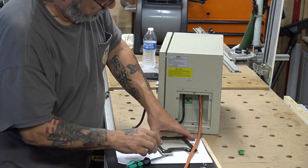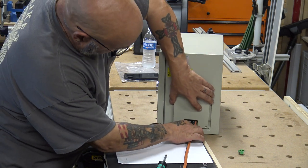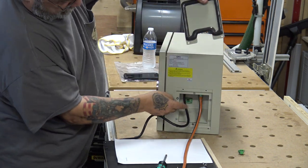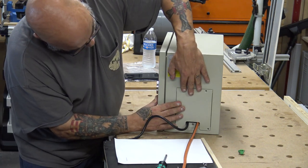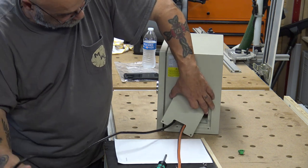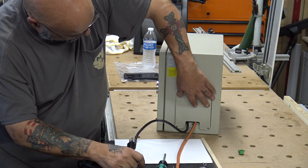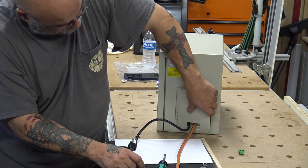Let's simulate the connection. Here's your tankless heater, and here's your power cord. The water flow sensor wire is very small. The gasket goes around and grabs the cord — this would get plugged into your outlet, and that's simulating your tankless heater. You put your screws in, it tightens up the gasket, and now it's water-resistant.